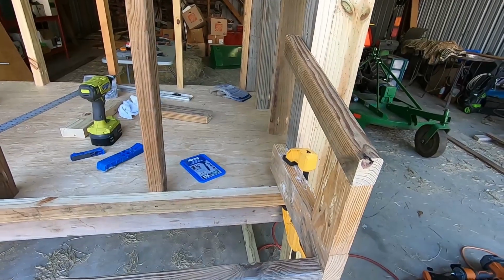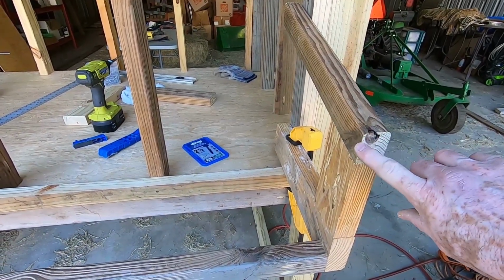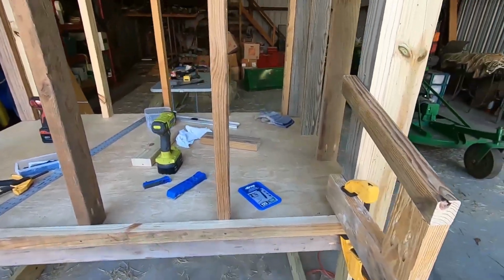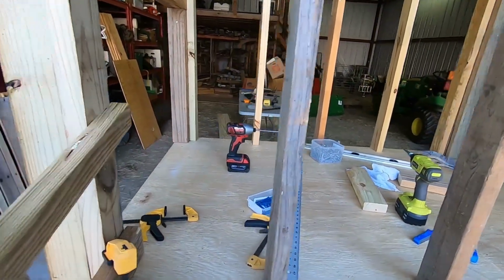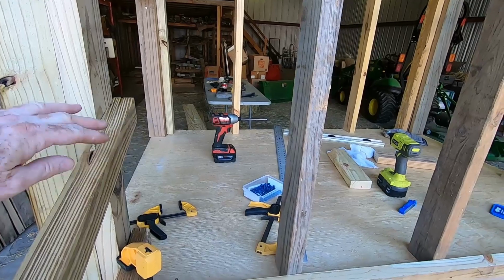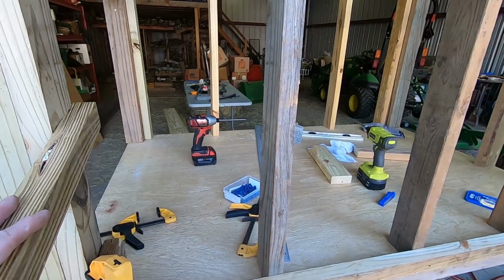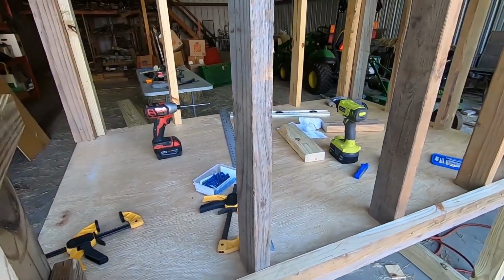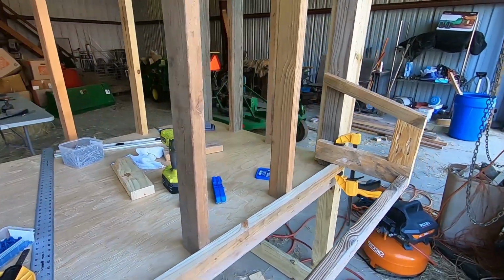So I'll take that board and put it at the same angle so that I can attach the metal roofing to it. And I'll probably use a 2x4, I would guess, to come in and go across, because I need something to attach metal to at the front of it as well. So I'll probably just take a 2x4, put it at the same angle, run it across, because its main purpose in being there is to attach to metal roofing.